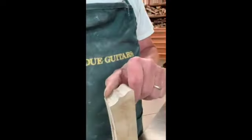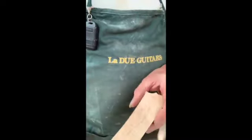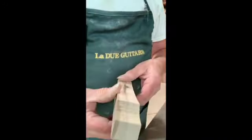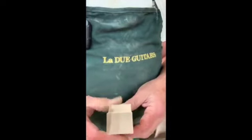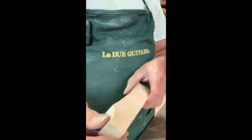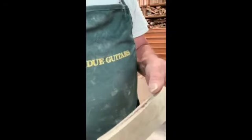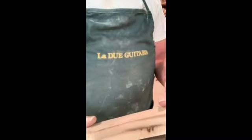The piece is bandsawn to reasonable shape. I probably would have been better off to switch and use an 1/8 inch blade here, but in the interest of expedience, I didn't. You'll notice that I started with a thick piece of stock. This happens to be about 1 3/8 thick. You'll want something that's at least 1 1/8 thick, because you want to end up with a template that's 1/2 inch thick, so that you've got plenty of surface for the bearing on the router bit to run on. So now I'm going to take my spindle sander here, and I'm going to refine this.